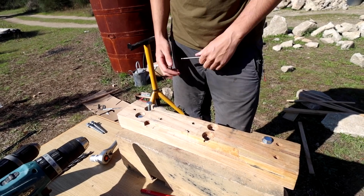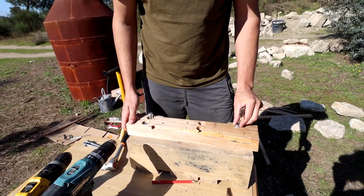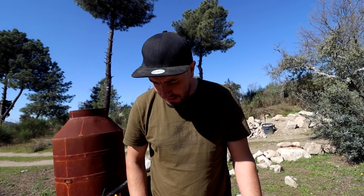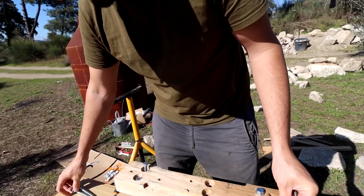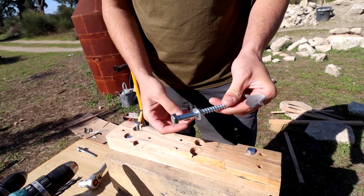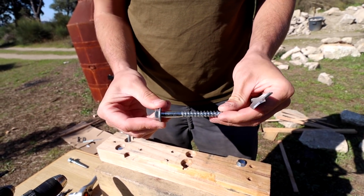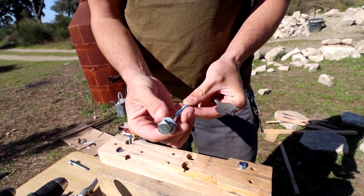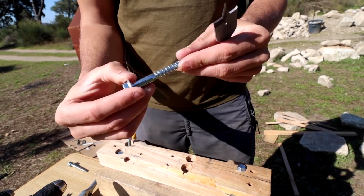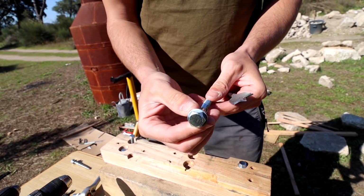And this wood you're practicing on is a piece of chestnut. This is a piece of chestnut, and basically the connection we need to make is a wood to wood connection. So these bolts are the perfect situation for it really. They're lag bolts. These are 100mm for the thinner beam, and then we got 160s for the bigger beam. And I put a washer on there to stop any tear through or pull through, whatever you want to call it, and that just really adds some more strength.